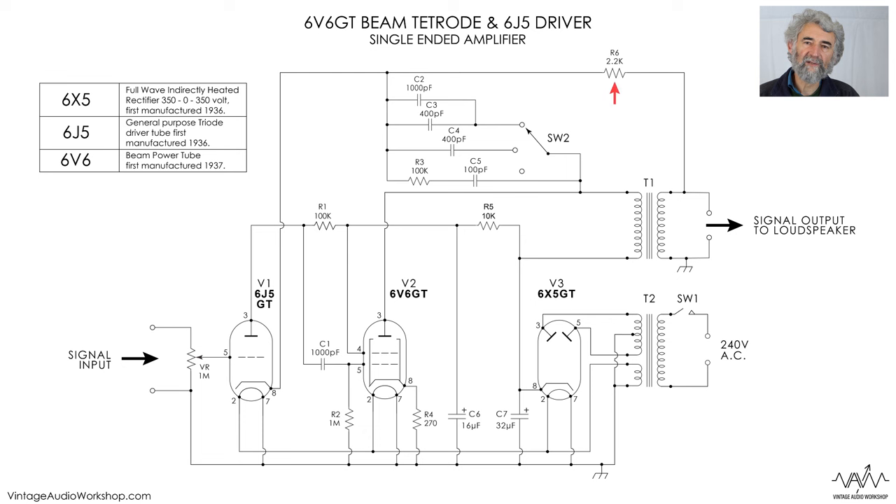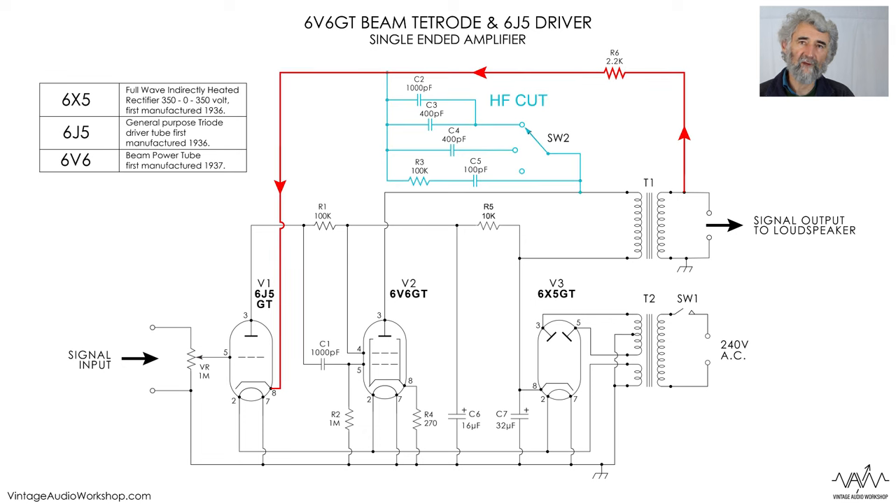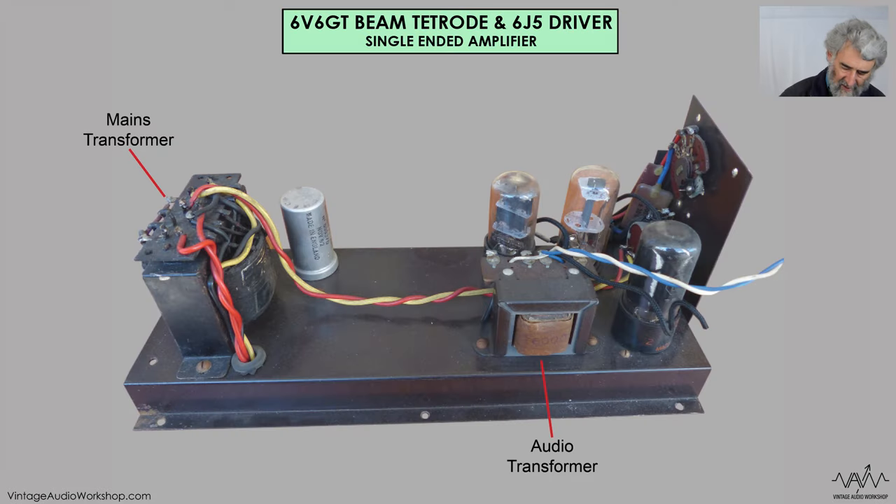There must be quite a lot of negative feedback, having the cathode resistor in series with the whole of the output voltage. Normally it will be fed back to a potential divider — the 2k2 would be in series with say 100 ohms and then several thousand ohms — but this is 100% feedback at low frequencies. However, with an input of a couple of volts from a crystal pickup, even if the gain in here is only times 10, you've now got 20 volts — more than enough to drive the output valve to its limits. So there is gain going spare in this circuit, hence one can have a lot of negative feedback at all frequencies, and then the treble cut.